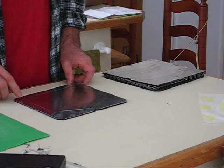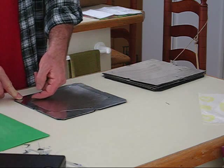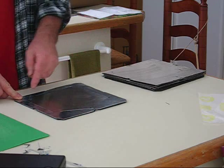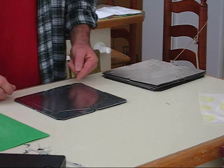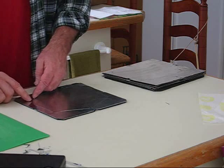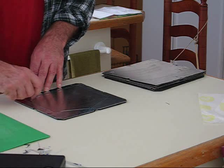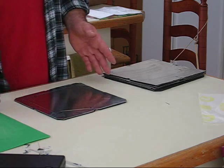I've nipped out the corner here so that the water can come in. This gasket right here is only ten thousandths of an inch thick, sitting on top. The water will come through that hole under that gasket and flow out into this area, flow over here and come back through the other way. It's important that the water flows under the gasket. If you had the water coming in the other way and tried to flow over it, this is so flexible — and when it gets hot it's going to be even more flexible — it'll seal that up right like a valve and nothing will go through. But if water's coming through from underneath, it's not going to stop it; water will be able to come through. Even if it lays up against the plate, there's still going to be a little crack to allow that water through. At least, that's the theory.